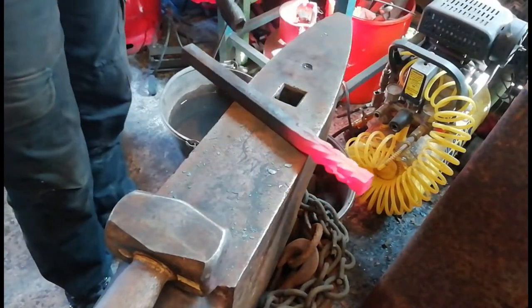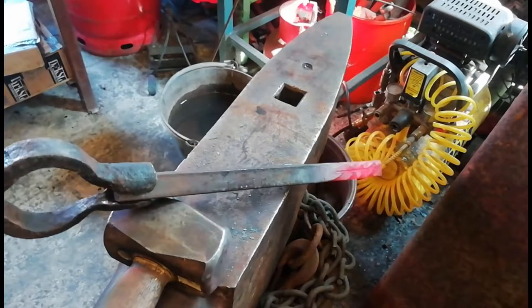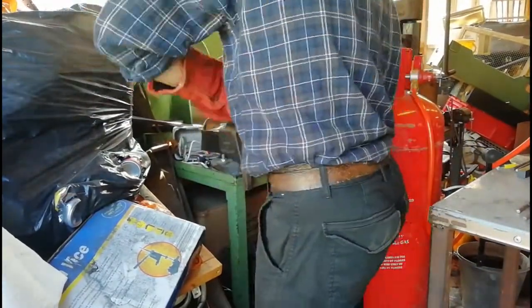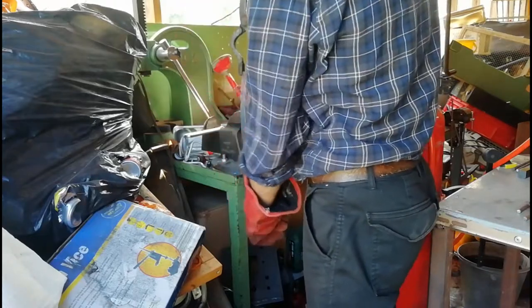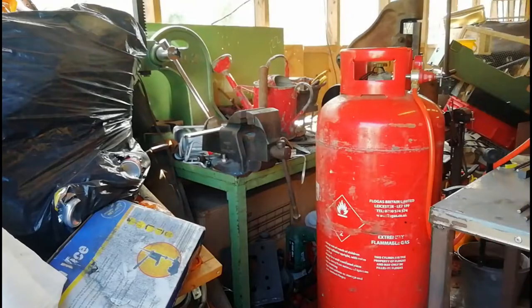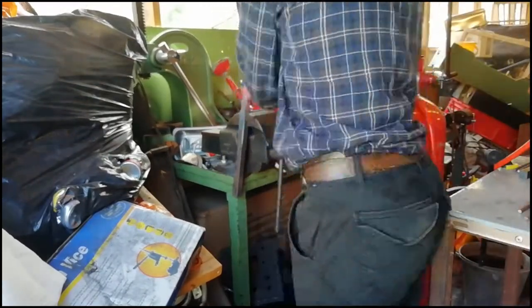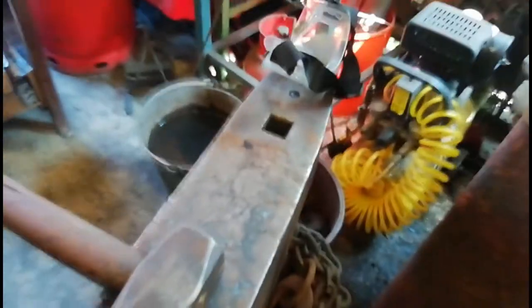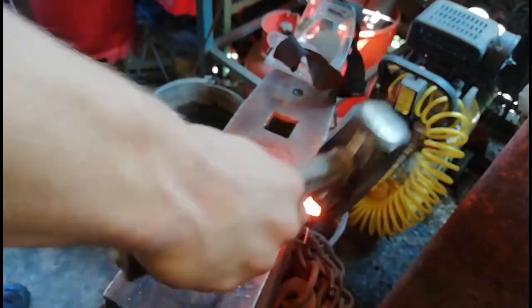So you're going to stick this in the forge, you're going to loosen up. We twisted it once clockwise. Now I'm going to twist this half a turn anti-clockwise. Out now. Okay, that's the most straight now. So now we can get on to the crocodile twist.